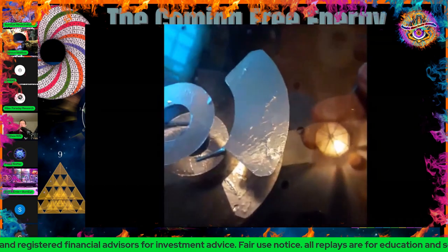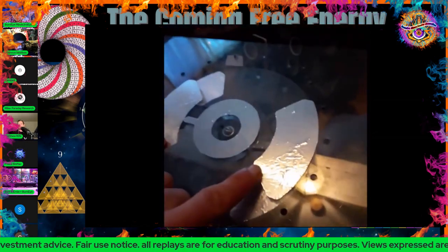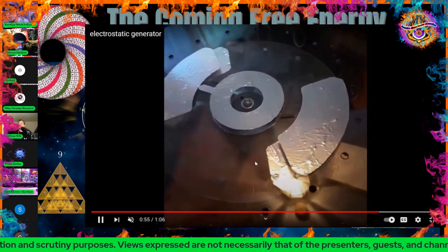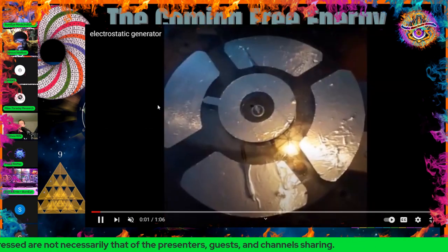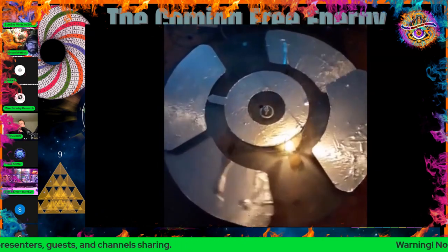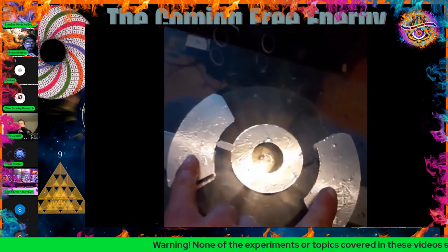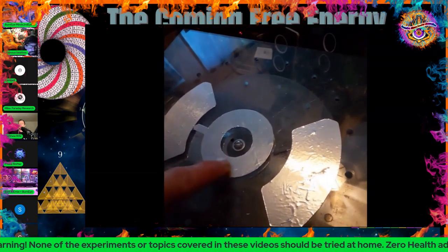Well, when that passes underneath the plates that are positioned above it, those ones there, it's going to induce an electrostatic potential into those plates. But because there's an insulator between, charge can't actually leap from the moving plates to the stationary plates, which means that the moving plates will never lose their charge, and the stationary plates can only gain and lose whatever induced charge is there. And since it reverses every cycle, they're going to end up having the same amount of charge, so they'll always be in good balance.